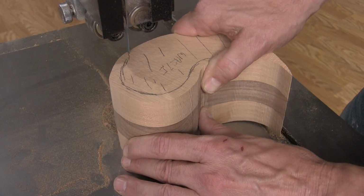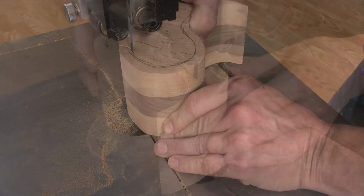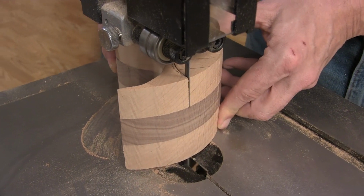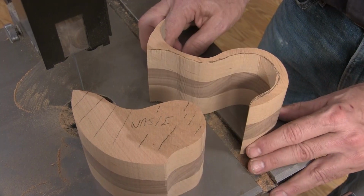With the sides sliced off, I roughly outlined the waste removal segment of the drawer. It doesn't need to be perfect, but do remember that with this particular bandsaw box, there's an upper and lower drawer, and the waste comes out of different sides of the core.